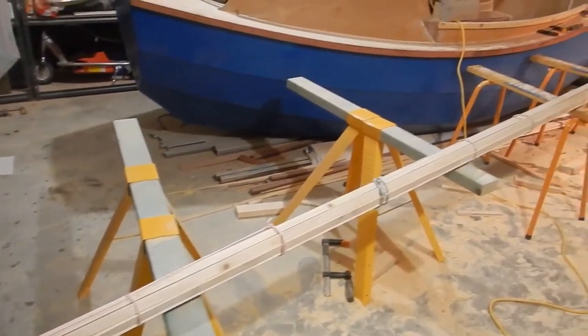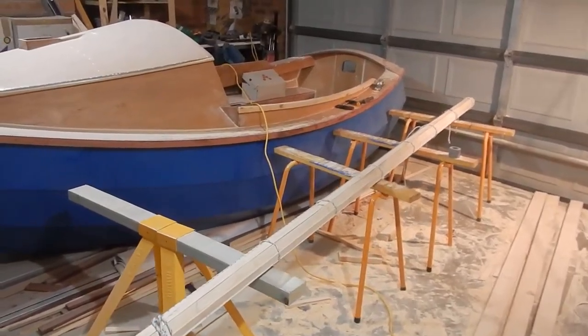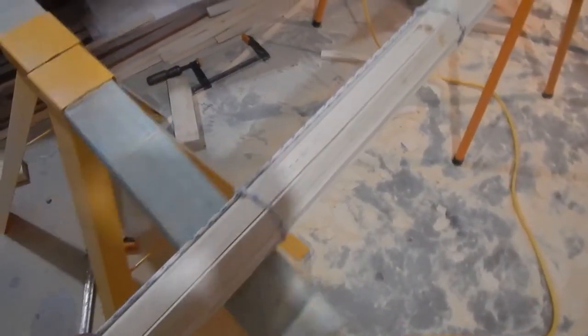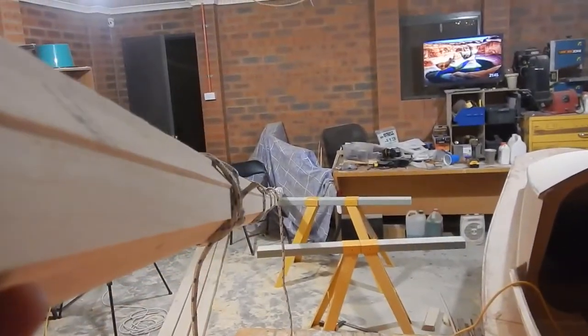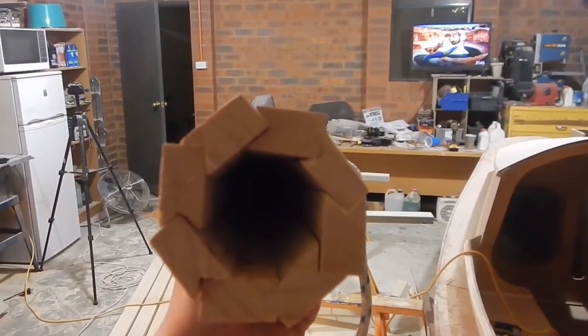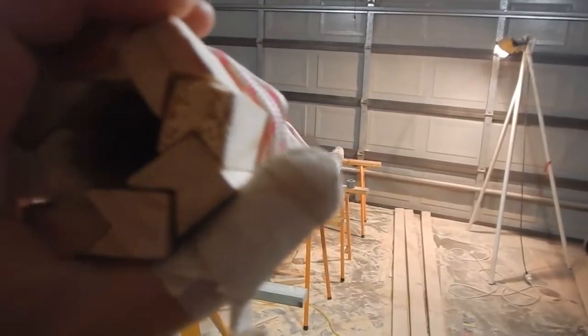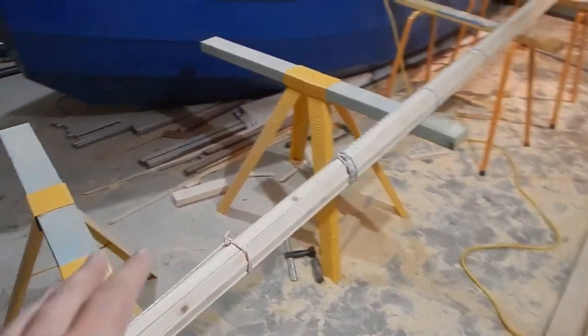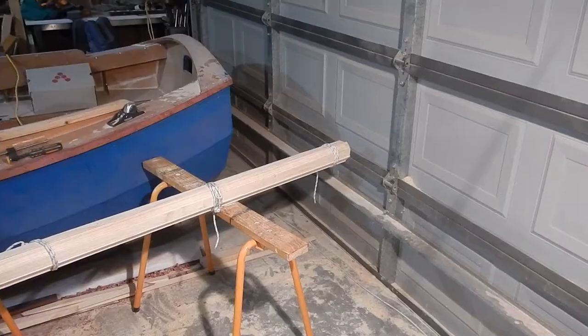It was a struggle, but here are all the mast staves dry-fit together in their proper configuration, tied up with some rope. I'm not sure if this is going to be the correct order of the staves — I need to stagger the scarf joints. It's a little bit bendy when I pick it up, but of course it's just held together by a few ropes. There's the bottom end and the much smaller top end. The fit isn't perfect and I need something better than rope to force them together — I'm thinking of buying hose clamps to really squeeze them. I need to go through and clean up some of the grooves; they're not perfect, but there'll be plenty of glue to fill the places I messed up a little bit. Mast!